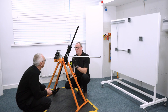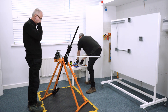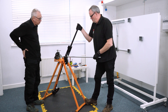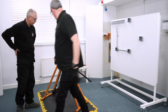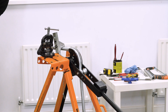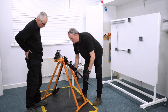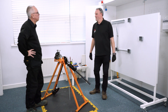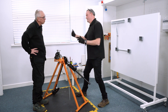This preserves the 90 degrees, so that's where I'm going to bend it, and that should then place it so it would fit exactly there. It's best to underbend rather than overbend. Push down at the same time - once it's going it's a lot easier. Now, what if this conduit was longer so that it went into the floor and you couldn't bend it? You would actually bend it from below upwards. Let's see if that's 90 degrees.